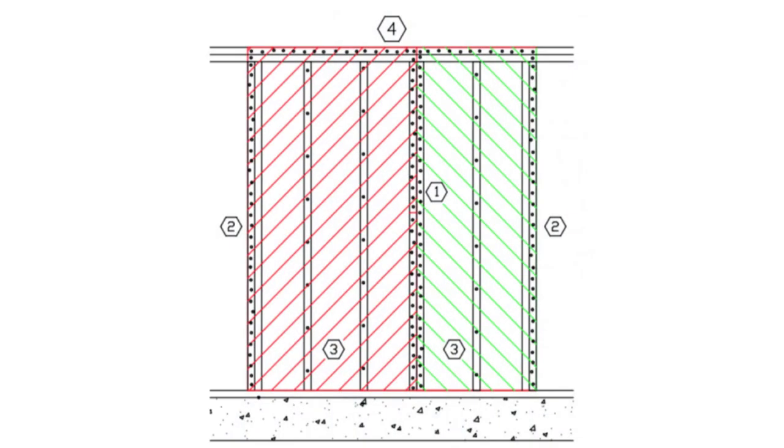Take a close look — you may need to hit your pause button to study it. This wall represents a wall we've converted into a shear wall. The red here represents one piece of plywood and another piece. This critical part here is called edge nailing — all along the edge of the shear wall, nails run along all edges of the plywood.